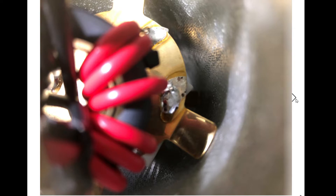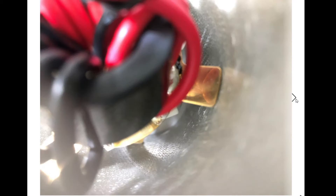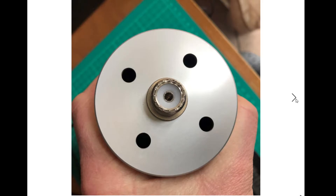Now, this is just a quick look. I used a little torch in one of the holes at the bottom of the matching unit and got my phone camera to have a quick look inside. You can see there's quite a bit of copper going off. There's obviously some form of ferrite ring there with six turns on the radiating element. I believe the black cable will be the ground element of it, but I'm not quite sure. Just another quick look down the fibreglass tube — that's looking up from the bottom, and that is looking at the bottom. Those holes are about three or four millimetres in diameter.